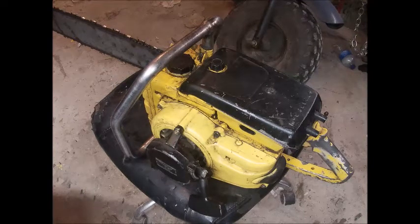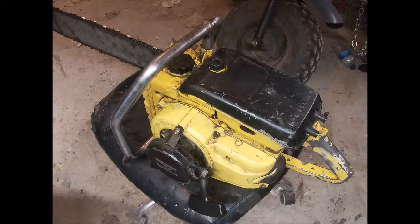Saws made around 63 or 64, I think. Maybe even 65. I just have to go back and look. I done covered 87cc's. We got this thing. The engine was stuck. It didn't take a lot to get it unstuck. Just a little bit of WD-40 on the PTO bearing and a little bit of heat, and it broke right loose. Thing had spark.